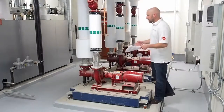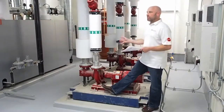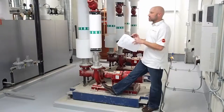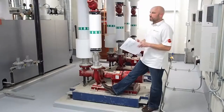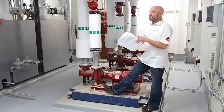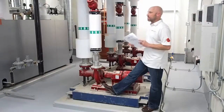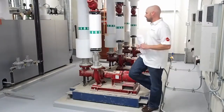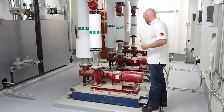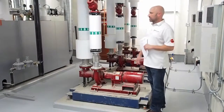If for some reason it's bound up, you might need to get that impeller loosened up from the casing. It only takes a small amount of corrosion in the casing to hold that pump impeller just enough to draw high amps when you try to start, and you might trip out. So get that turned over free by hand before you fire it up. Any questions on the 1510 end suction pump?